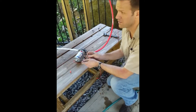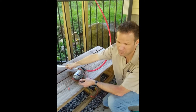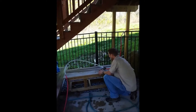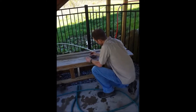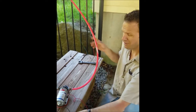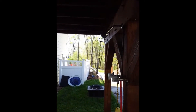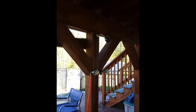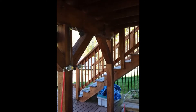Now when we make this connection, the pump should turn on and start drawing water from the hot water barrel and prime this tube. If you open up the hot water faucet over there, it'll let water go through. It is on all the way counterclockwise. Now let's see if this turns on — I'm going to put my wire nut on here. The pump is now running. As long as the other end of the tube is in water, it should start to draw water and push all the air out. There's probably 50 or 60 feet of PEX tubing between here and the house.